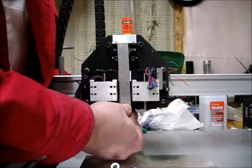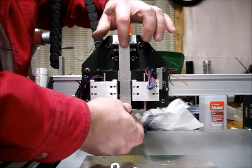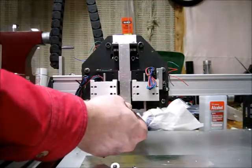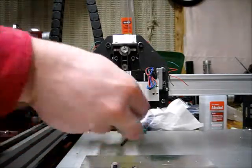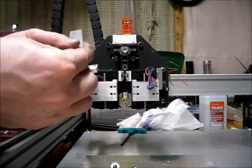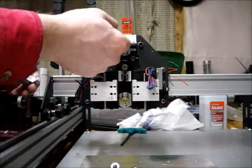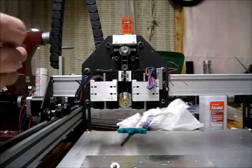I'll get this attached here, and this attached up here like so. Once this point and that point are secured, I'll put the bolts in the back. Then when this tries to tip, it'll actually push against the bolt hole in this piece and keep it from doing that. It'll just be locked in there — unless it causes this plate to flex, which hopefully won't happen with that much force.